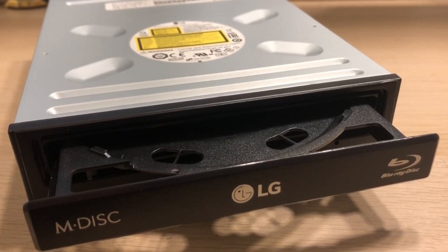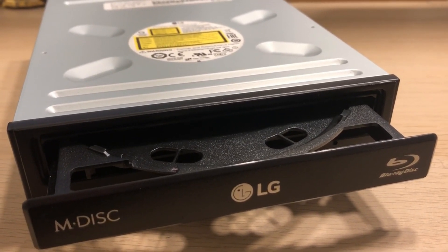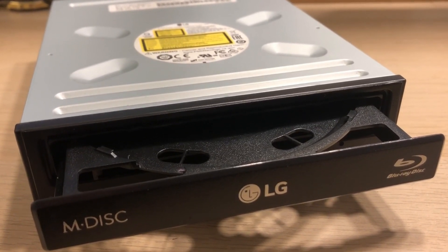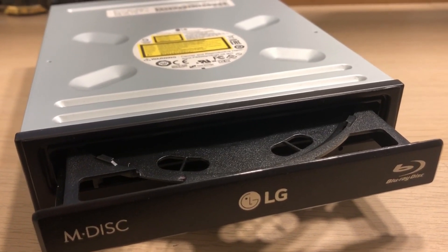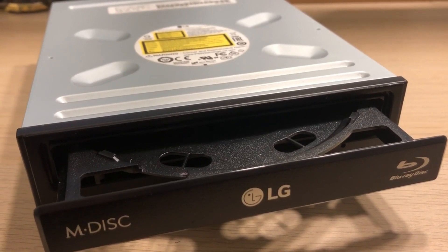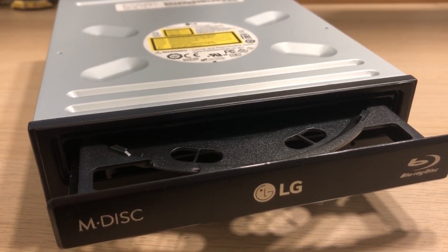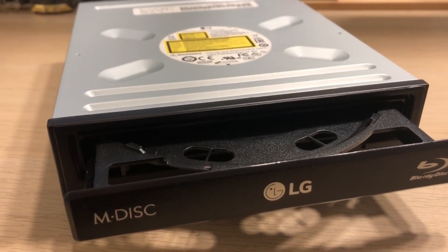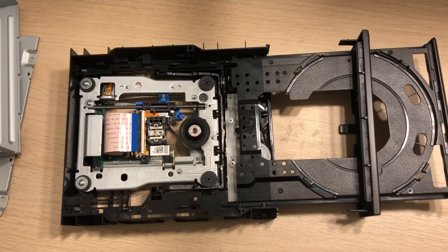You could say this drive is possibly a victim of a design fault — LG may have just made those connections a little bit too weak. Given the movement of the head on 4K Blu-ray as well as standard Blu-ray, maybe that was just too much for this drive. That's why we're seeing a lot of these variants of this LG drive failing after just a few years. Thank you for watching — please like and subscribe and I will make more in the future. Bye for now.